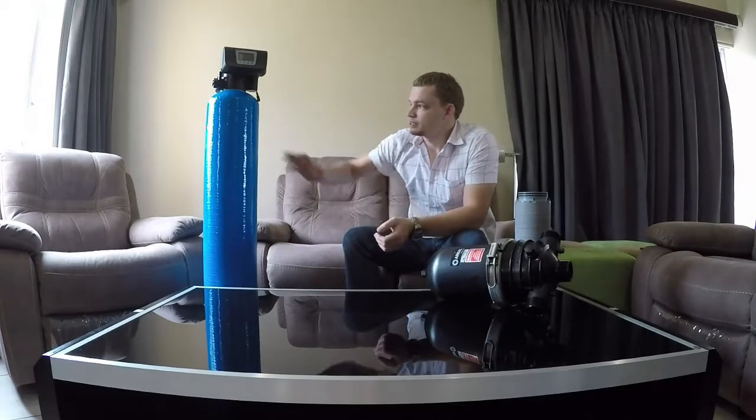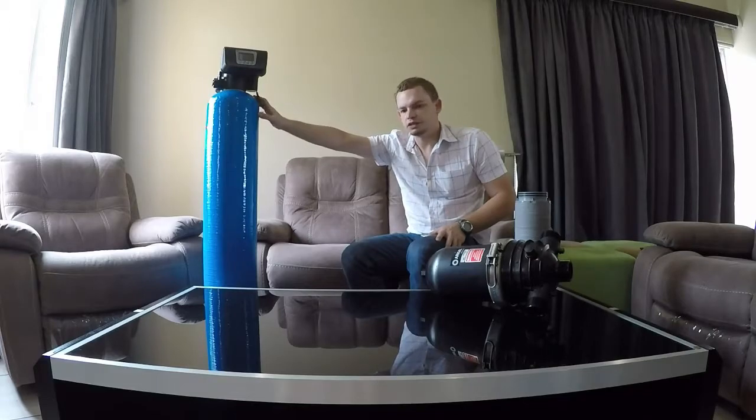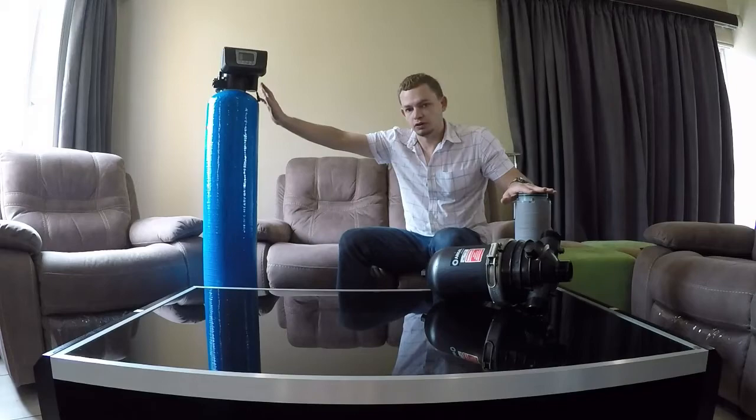What we would recommend then is a sand filter in a similar vessel. It's similar to a pool sand filter in that you use the same media, but where a pool sand filter is short and fat — designed for very high flow — this vessel is very thin and very long. That gives you a much longer contact time with the media, catching much finer particles. We recommend placing the sand filter first, followed by a finer filter such as a disc filter or glass media vessel, so you end up with fairly clean water going into the tank.